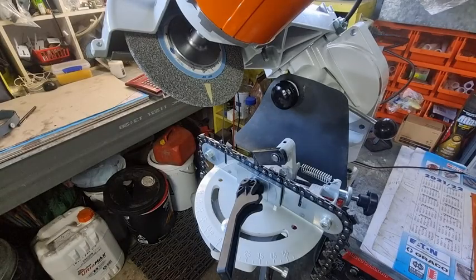There are a lot of things totally different about this grinder. Now, 10 degrees downward tilt was first introduced way before grinders came in — people did that with hand files. It thinned out the working corner and reduced a bit of the hook. The reason Stihl abandoned the 10 degrees downward tilt, especially with files, was that people overdid it — they over-tilted and were doing more harm than good. I've tried time-based cutting using 10 degrees downward tilt and not using it, and on the chain I was testing it didn't make any difference, though there may be some chains where it does.